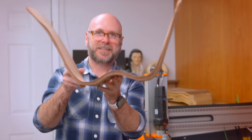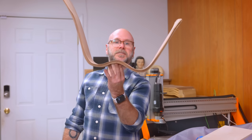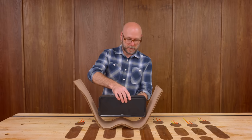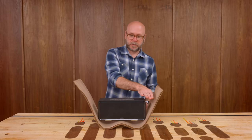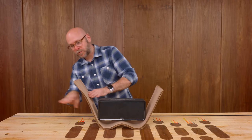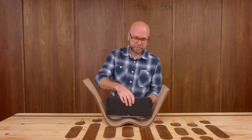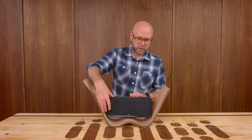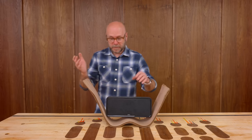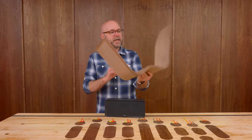We got the win! I love vacuum press bent laminations — that's so cool. It's going to sit like that, go inside here, and there's purposely going to be a space on the bottom, then we cut off the top. We're going to glue in a straight piece of wood and make room for the buttons up top. We need to clean up the edges and chop off the top, and the speaker will sit back a little bit so we can add some grill cloth to the front. That is so satisfying.